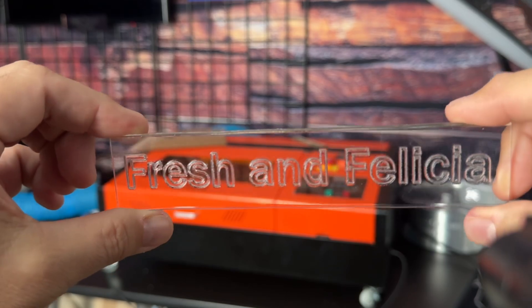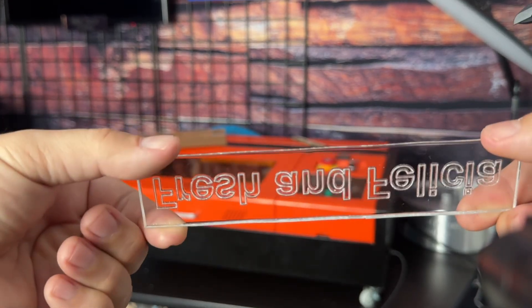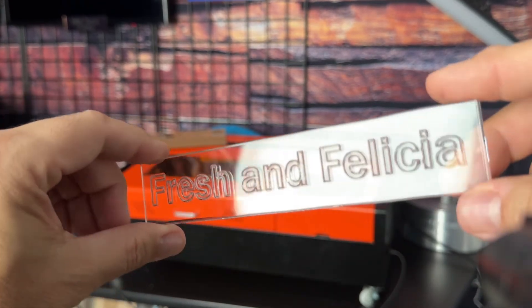Then we just did regular engraving at about 20 millimeters a second. I'm keeping everything at about 80% power. I know you're not supposed to go that high — it doesn't like to go there because it wears on your laser tube — but I really want to show you the capabilities here. And it really doesn't do much under that. You can do it at 40% at a slower speed, but then you have some more flashback. So I really want to get that speed going so the power goes through further and it doesn't burn or melt.